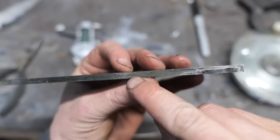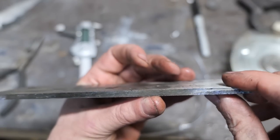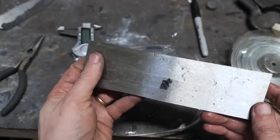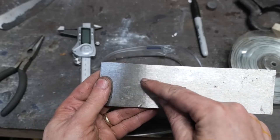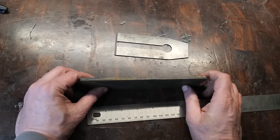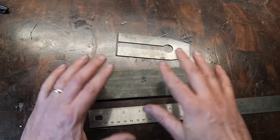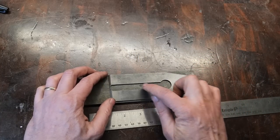I've thinned this out a bit. This little line here and down is the 15N20 edge that I have to work with — I don't want to make that any thinner if I can help it. I've got this little divot I'm gonna have to grind out, but I think I have enough material to bring down the width of the decorated part of the blade. Now I just gotta work on getting the hole drilled and the slot milled. I don't want to quench or harden this any thinner than it is now because it just gets predisposed to warping, so while it's soft and this thick, I'm gonna have to drill the hole and mill the slot.